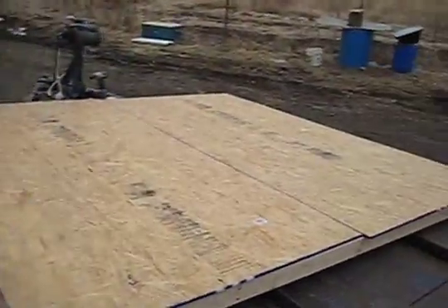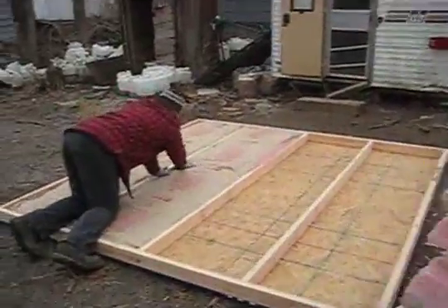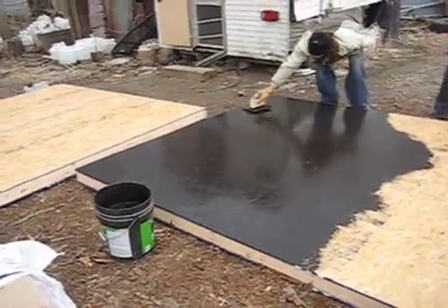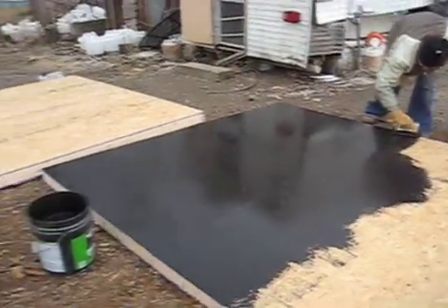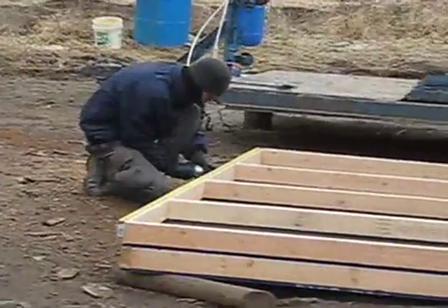It's modular, industrial, quick, and simple. It's just a six-sided standard set of framed panels, 8x8 feet in size, with 2x4 lumber and oriented strand board, OSB, faces. It's got R13 insulation inside, and it takes about a day to build with a team of four people. Even two strong people can move a panel by hand. The panels are light enough so that four people can move them into place quite easily, even the roof.